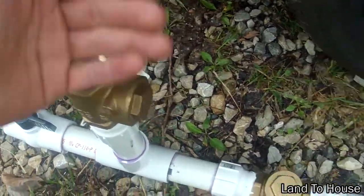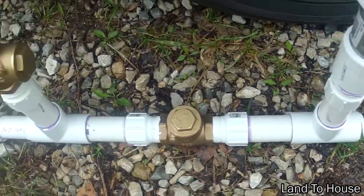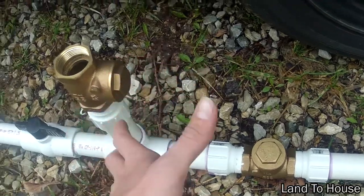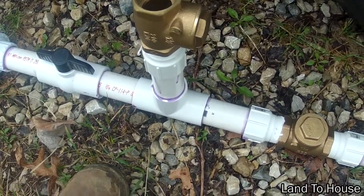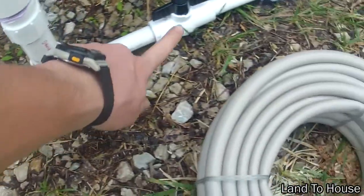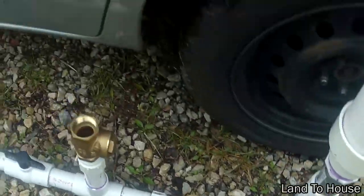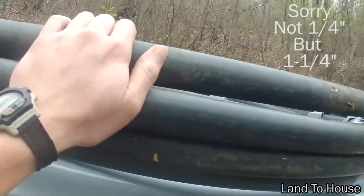So: water out, closed, closed, water in, backs it up. It's going to have a pow-pow kind of action. Now 90% of the water is going to flow out of the waste valve, and only 10% will go into the hose. But 10% from a one-and-a-quarter-inch tube is still a lot of water.